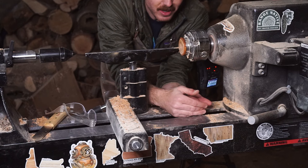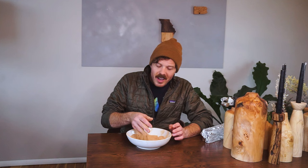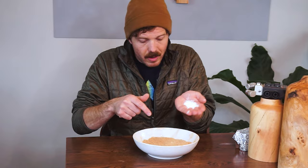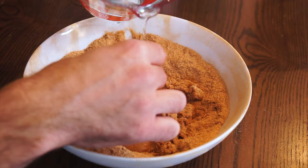Now what I'm going to do is just gather some of this gorgeous sawdust from off the lathe, primarily from the bandsaw. We've got our sawdust here and from this point it's pretty simple — all I add to it is a little bit of xanthan gum as a binder. Mix that together and then I just start adding water a little bit at a time, mixing it together until it reaches the right consistency. Makko powder is another binder you can use that adds that classic incense scent. I use xanthan gum specifically because it doesn't add any kind of scent — I want to smell just the wood itself, especially when you've got a species like juniper. There's nothing I can add to this to make it better.